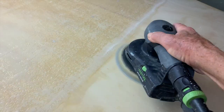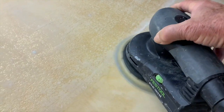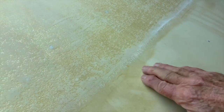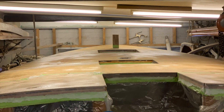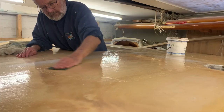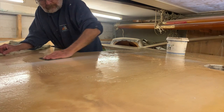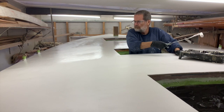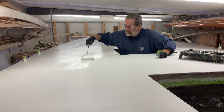I aimed for minimal overlaps and did the whole deck over three sessions, so I sanded a feather edge on the dry cloth and laid masking tape close to the edge to make it easier to remove overlapping cloth. The cured surface ends up about one millimetre thick. I scoured and sanded the deck, sanded the overlaps flush, and added two more coats of clear epoxy to fill the weave, scouring between coats. Then I applied three coats of high build epoxy primer, which I won't sand until ready to apply the deck paint further down the track.